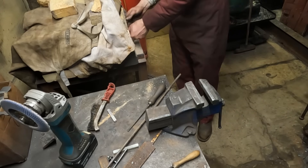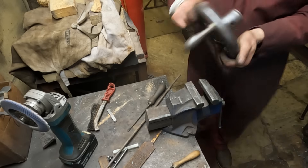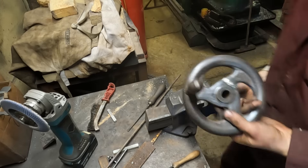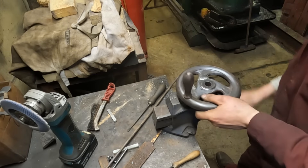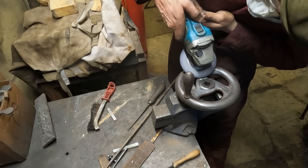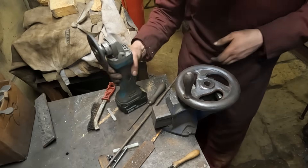With that machining done, it's time to take a look at the hand wheel. I'm pleased with the weld — there are no signs of inclusions on the surface and no fractures on the part, so it seems to have been a success. Let's hope it cleans up just as well. I'll start by removing the bulk of the material with the grinder and then finish and blend in the repair using a file.